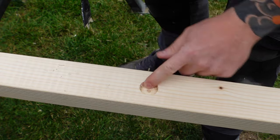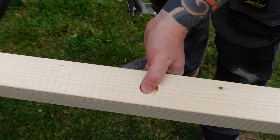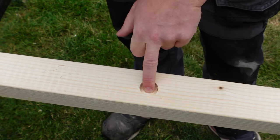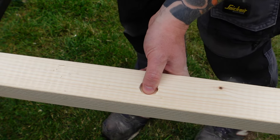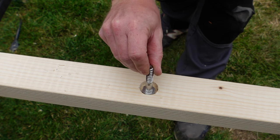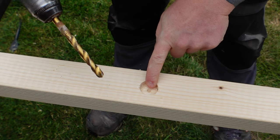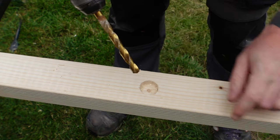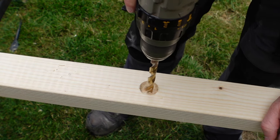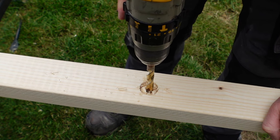It's best to take a little bit out at a time rather than too much, because we want enough thickness to remain in this piece of wood to allow the coach bolt to pull the wood tightly to the brickwork or concrete surface without splitting through the other side. Give the recess one final check so you can see the head will be recessed properly in the timber. You can then use the hole made in the centre of the recess to guide a 10mm drill bit through the piece of wood — make sure you get the hole perfectly straight.